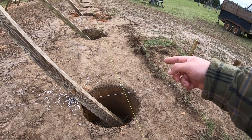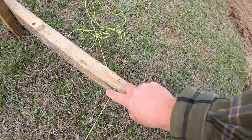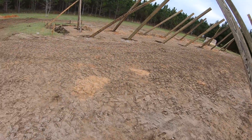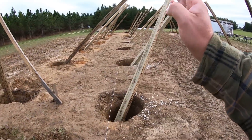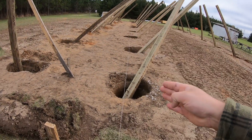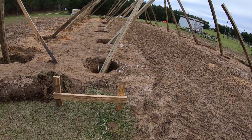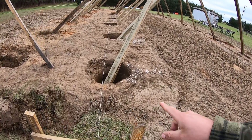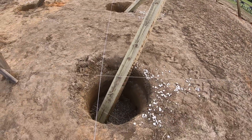You can always take the strings up and down as you need to come in here and dig holes and put posts in. The only way to make sure something is truly square is to measure from a corner to corner. They can move these strings up and down the board until they make their mark, put their screw in, and lock them in for the rest of this build. It's critical to measure corner to corner, and you can make that with strings.